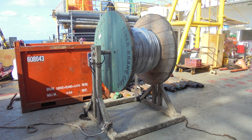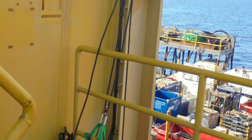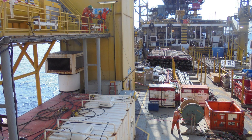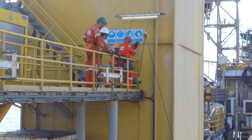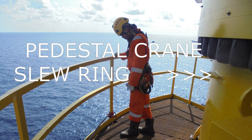This thick copper cable is heavy, so we set up a pulley system to hold it up easily. There's the cable drum on the deck and the guys on the elevated walkway pulling up the cable using pulleys. From this point onwards, the cable follows the path of the stairways as it spirals up to the platform just below the slewing ring.